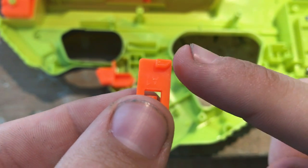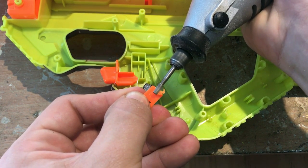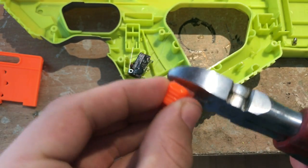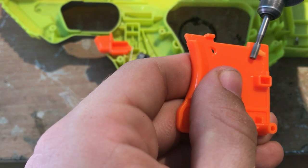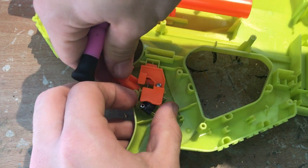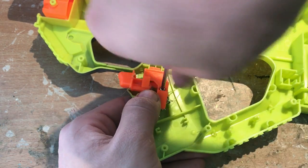Let's remove the trigger locks. For the Raven, remove the small knob on the rev switch and grind it away. Using your snips, snap this plate off your rev switch. Also, remove the nub from the Raven trigger. Before screwing down the trigger assembly, re-grease all your parts so it functions smoothly. Now put your parts back together and screw them back together.